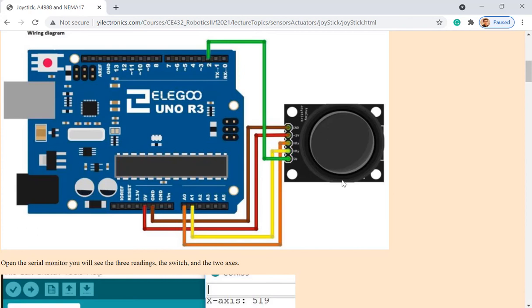There are some digital joysticks as well. You have to power them up, and then whenever the value is changed by this little knob, it directly outputs I2C or SPI. So these signals occupy more GPIO resources if you need to use I2C somewhere else. The joystick has to occupy that I2C just for a little actuator. It's not making sense. I prefer using this potentiometer version, actually. It's cheaper as well, and works pretty well.